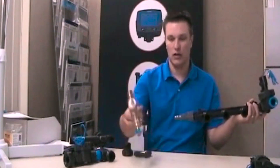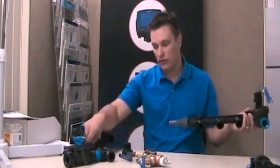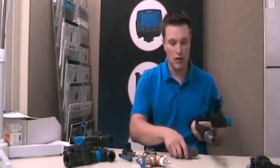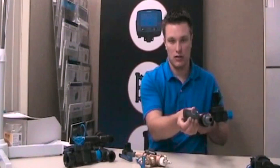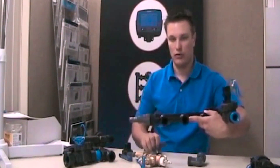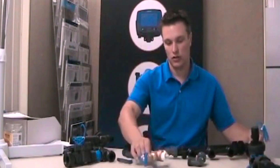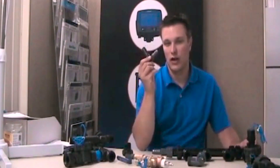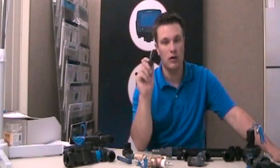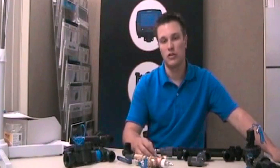You can come straight down and over into your manifold so it sits just over from your cap, or if we've provided you with an elbow to come back at an angle, you can come straight down from your house connection and put your valves just in front of it. That's what this fitting — the IF1406-007, three-quarter inch insert elbow — is for, and hopefully it makes your installation a little bit neater.